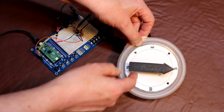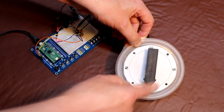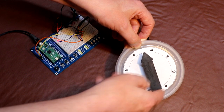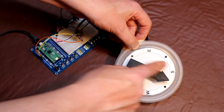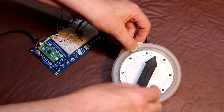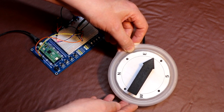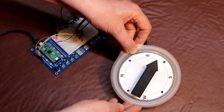The only problem is, if for whatever reason the wind never blows from the north, you could actually be out of alignment here. You could be providing the wrong indication and you wouldn't actually know it because you hadn't redatumed the system, you hadn't set the reference point. So really what I would like to do is use some form of encoder that isn't reliant on keeping this count value. It's not reliant on the microcontroller remembering it. Well, there are types of encoder that can do that, and they call those absolute encoders. So let's look at those now.